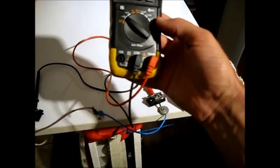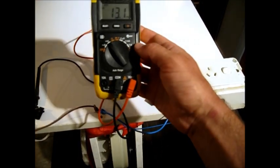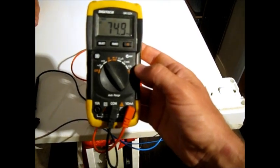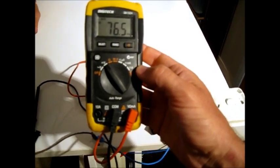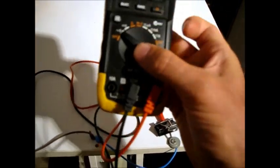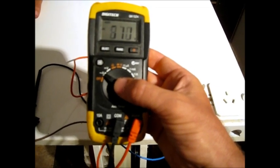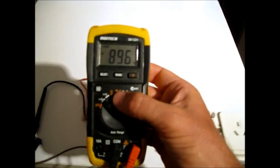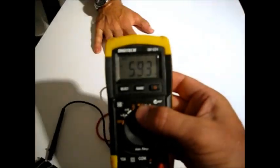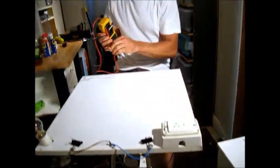Is it an AC motor? Is it alternating or is it DC? I think it's DC — I'm not even sure. Let me put it in volts DC. Turn it real quick just for a minute. We've got 75, 76 volts — no, it's millivolts. I think this is AC, I'm pretty sure it's AC. Turn it now — turn it slowly. You're kicking out 300, 400 volts... 800... 923... 940... 950... a thousand. You peaked at a thousand volts — a thousand volts AC.